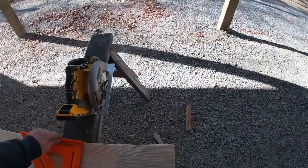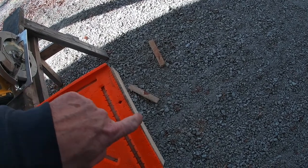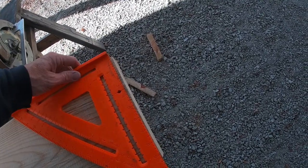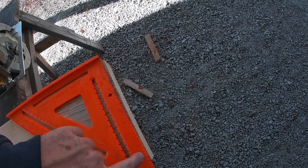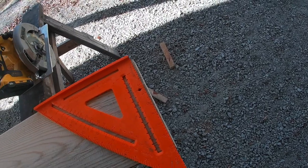A quick tech tip: when you are putting up wood — even if it's rough cut, but really any wood coming from a manufacturer — if you get a 12-foot board it'll be a little more than 12 feet, but the ends are not going to be square in most cases. Use your speed square to check, and you can see how much of an angle it's off. So I'm going to do a quick cut and square this up for a nice straight square cut.